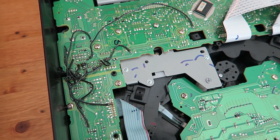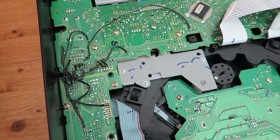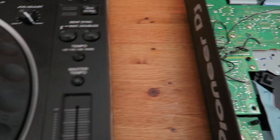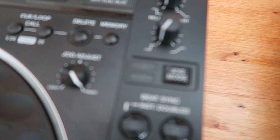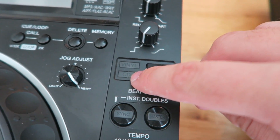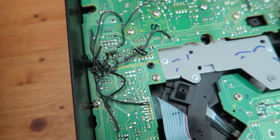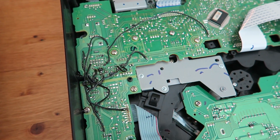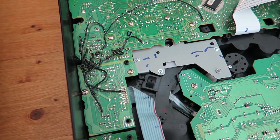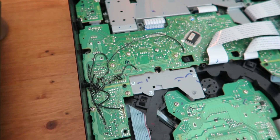So I went through and cleaned up a few of the lines that I ran, and it looks like I'm going to have to order some LEDs to replace the CDJ vinyl mode button. It has green and blue indicators of whether you're in vinyl mode or CDJ mode — you can see them on the other CDJ. The LEDs for the deck I'm fixing are the only thing I can't get right now — I think those LEDs just need to be replaced. I have a gig with these this weekend, so I'm just going to assemble this, test it, make sure everything's fully functional, and then wait until I order some LEDs from DigiKey. Then it'll be fully functional.